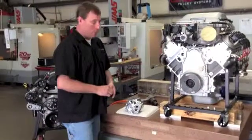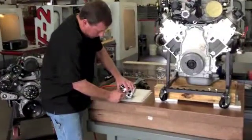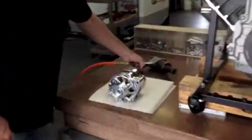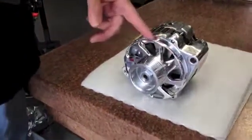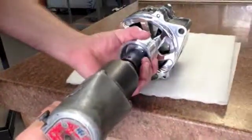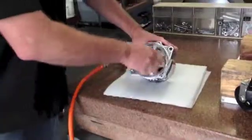You don't need to beat them on, or you can cause the shaft to move. Then we're going to put the nut and lock washer on the shaft, and we'll take an impact wrench. We do not hold the fan — that thing could cut your fingers. We're going to hold the pulley with our hand, tighten it up, make sure it spins freely, and we're done.